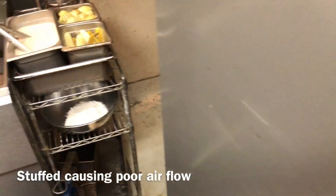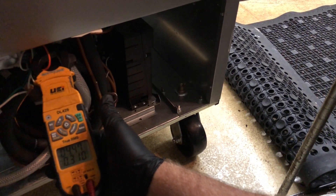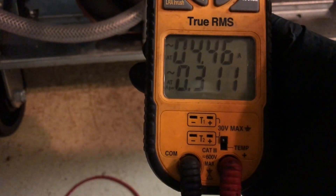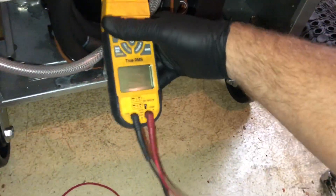That's why we're hurting on airflow. There are two issues: one is that bottom shelf and the airflow — probably not enough airflow on that bottom shelf. The second thing is it's got the residential-style time clock and it's not getting enough defrost for as busy as they're in and out of this freezer. I'm probably going to end up replacing that time clock with one I can program for more defrosts, so it'll be a mechanical time clock. Yeah, a little short on airflow inside the box.